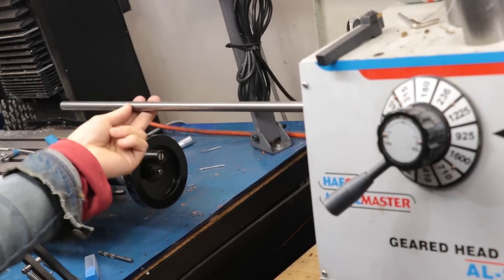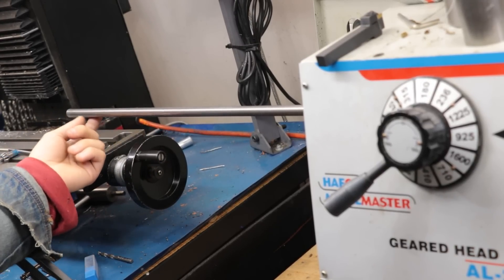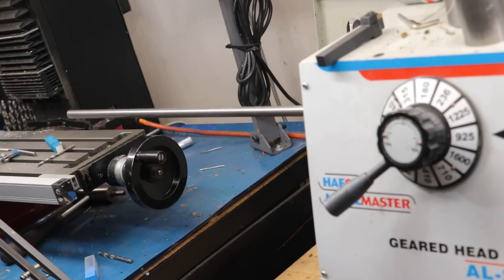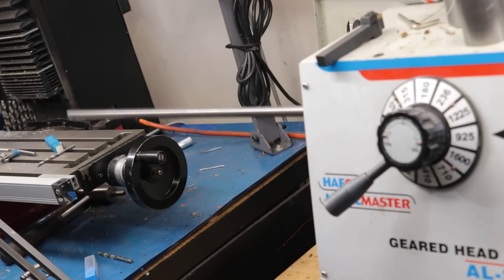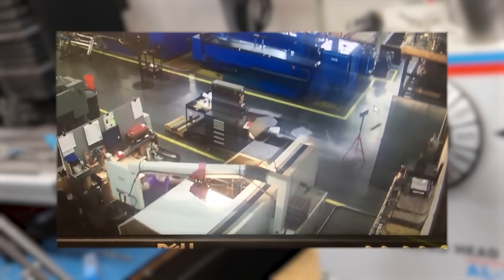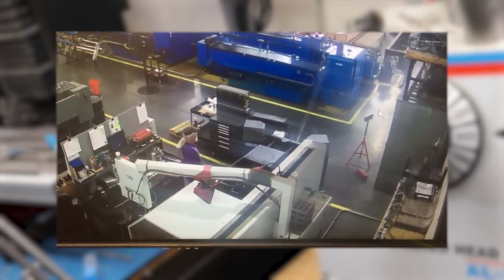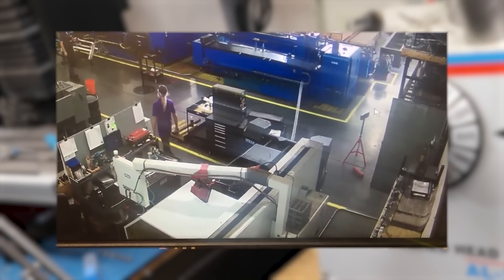However, the longer the rod the more unsupported mass is going to be at the back of the lathe, and even with a small tap it's causing it to wobble like crazy. If I was to run this at 800 or 900 RPM, which is what I'd normally do, this would get out of hand really quickly. I'm sure most of us have seen that video where the stock wobbling on a lathe causes it to bend, eventually taking out a chunk of the flooring, a bunch of cabinets, and causing the lathe itself to physically move. That is the last thing I would want to happen in this workshop.